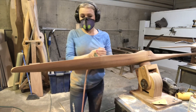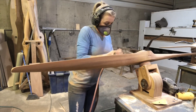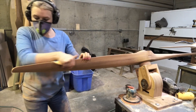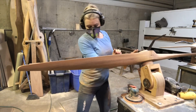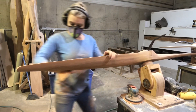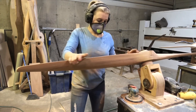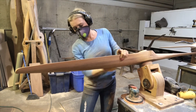I'll take a belt sander with 60 grit and go over the whole thing to take all the lines out that the lathe left. Then after that I sand it with about 60 to 80 grit orbital sander to take out the lines the belt sander made. Mahogany is really nice to work with — it sands so fast, but it also allows you to screw up really fast too. You have to be careful and not be too aggressive with your grit or pressure, because you can dip it very easily. But it's also very light wood, which is great with a propeller this size — it lightens the weight quite a bit. It's also beautiful and perfect for World War One replicas. This prop is going to go on a DR1 triplane — I'll have a picture of it at the end of the video.